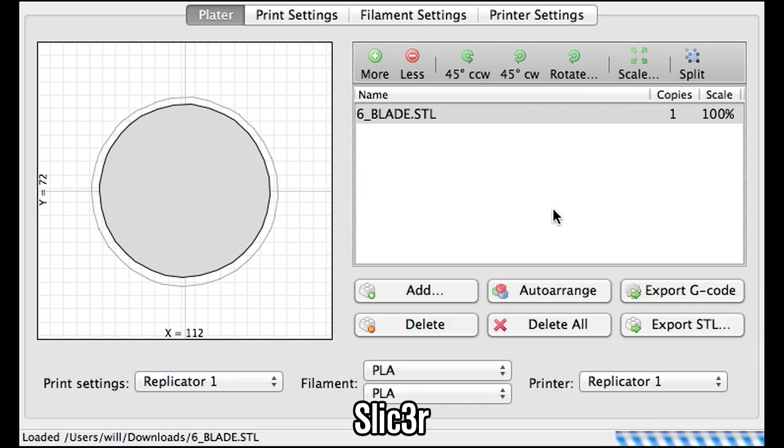If you're just starting out, then MakerWare is great. It's an easy way to learn. You're not going to get really high-quality prints out of it, I find. But it's great at the 0.27 millimeter resolution. It's very fast. They use their own custom proprietary slicer code that is much faster than the SkeinForge default. When you go up to the 0.1 millimeter, 100 micron resolution, then it gets very slow, and it actually uses SkeinForge. And when you're saying very slow, you mean the actual computing and running the program.